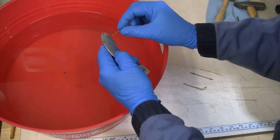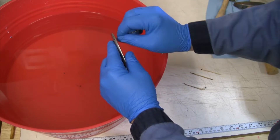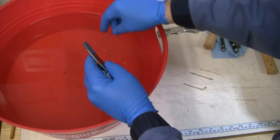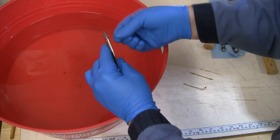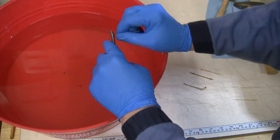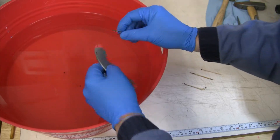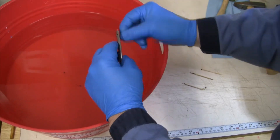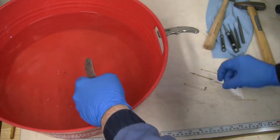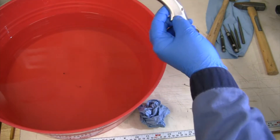Let's see how we're doing on this one. I'll take a tap drill and see if that'll help me dig some of that out a little bit. It works better than a toothpick. The real benefit is it scrapes away that black oxide layer and exposes more surface area of the bare tap. I'd recommend that — get rid of the black layer and get it back in the ferric chloride and let it do its work. This one's gonna have to go back in a little more.